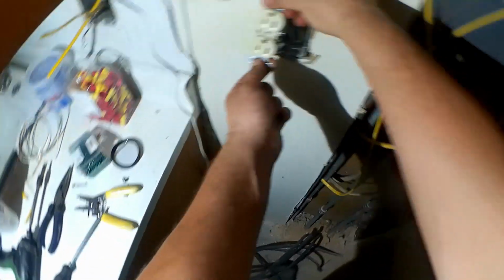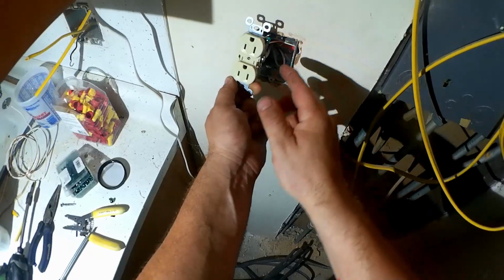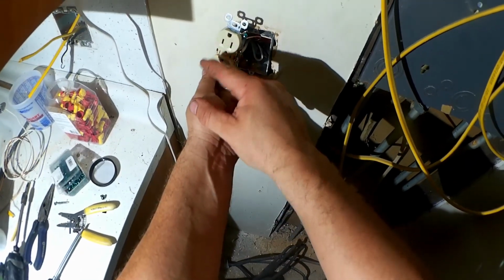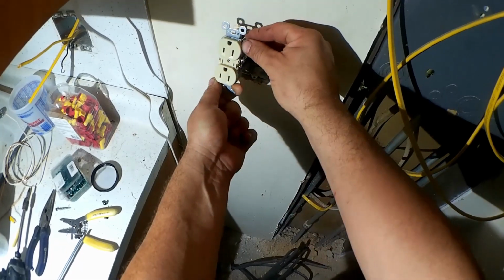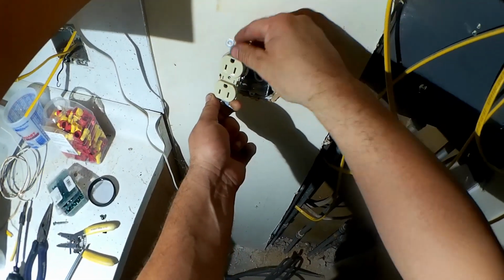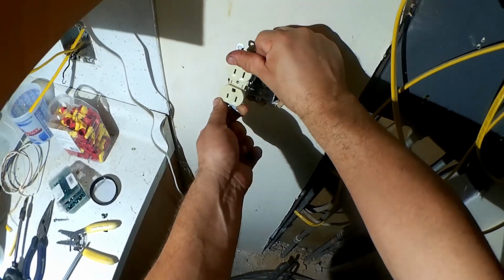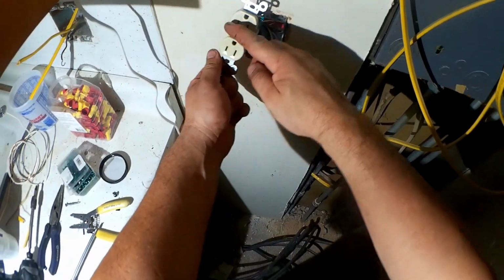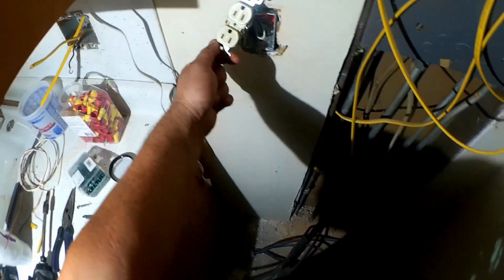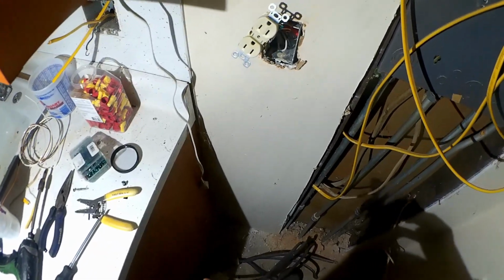safer to put them in this way, because if you have a wire pulling on a plug and it's sagging partially out of the receptacle and you drop something metal down here, that in this case it would hit the ground, whereas the other way it would cause a short across the live and neutral. And well, that's a valid point.